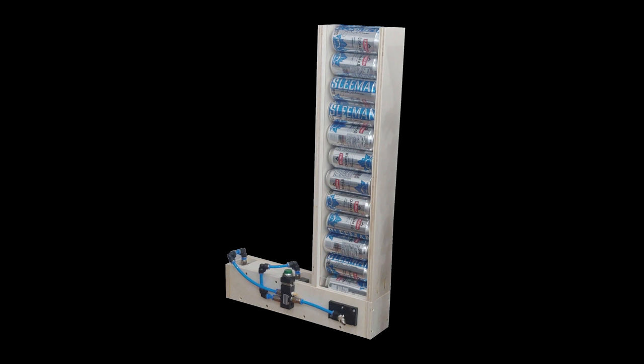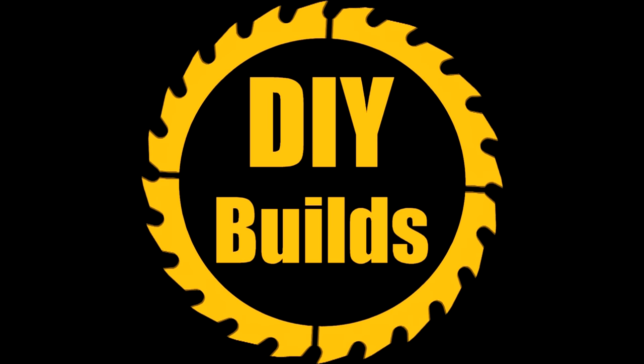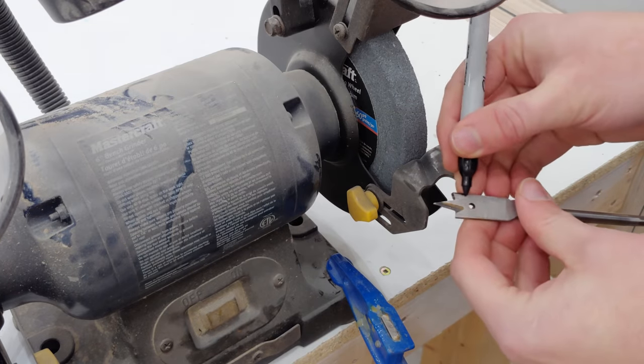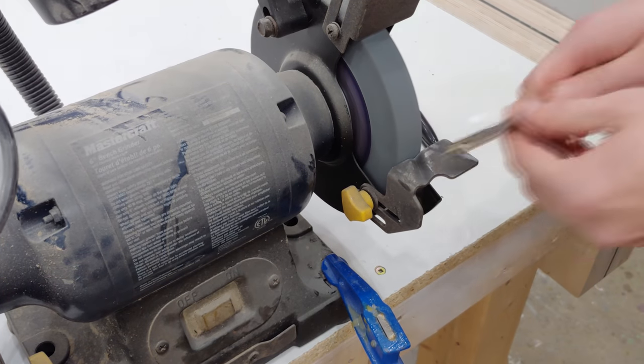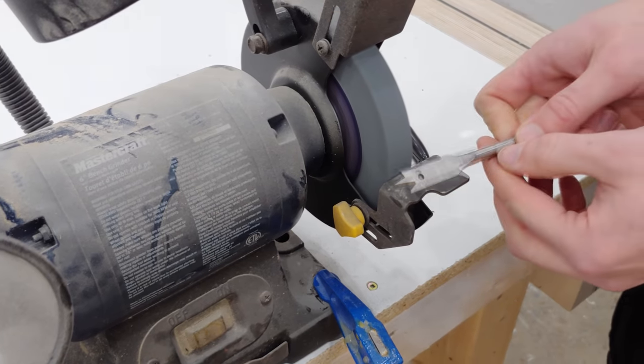It's time for the big boys to come out and play. I start off at the bench grinder where I can take off a small amount from the outside of a 5/8 inch spade bit, as the 5/8 inch hole was too large for the piston of the pneumatic cylinder to thread onto my plywood ram.